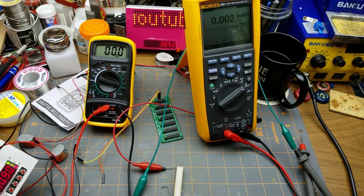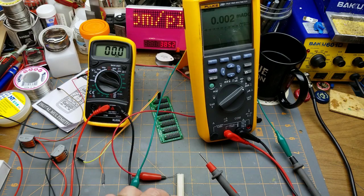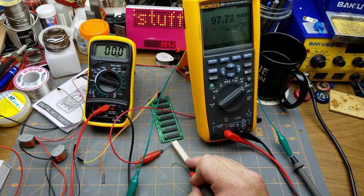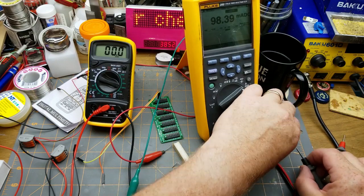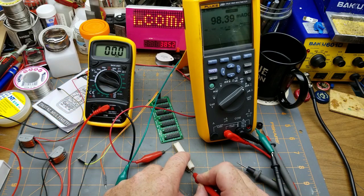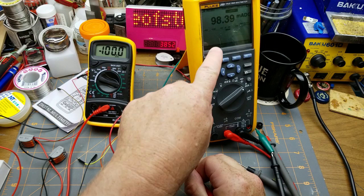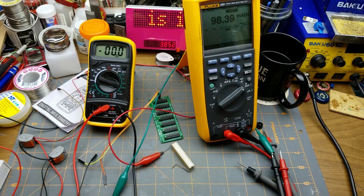I've got a little over 10 volts on this power supply and a nominal 100-ohm power resistor in series to give us very close to 100 milliamps. Quickly switching things around — same test lead, same test clip, same resistor, only the meter and its own leads differ. The Fluke reads 99-something, basically 100mA. This guy reads 100mA as well. That's pretty damn close — good enough for that current range.